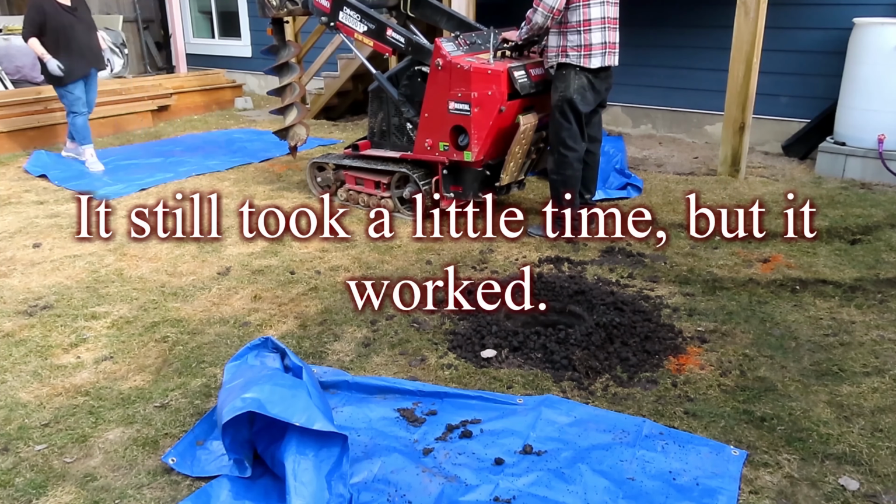Cut rebar into the correct lengths. I'm using fiberglass rebar, which is easy to cut. Mix concrete and fill the building form tubes flush with the top. Insert 3 pieces of rebar into each footing. Insert a steel post support, saddle bracket into each footing.